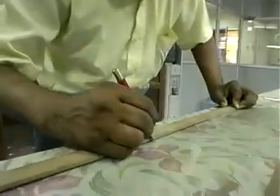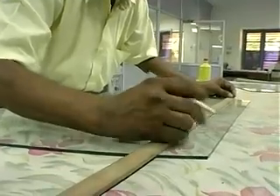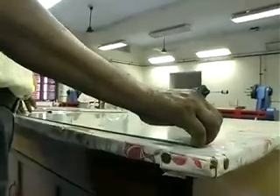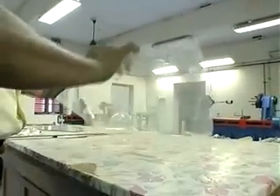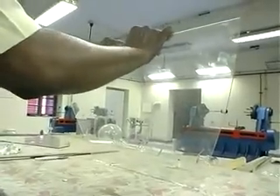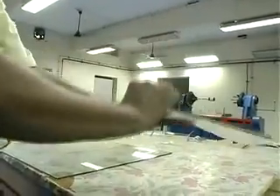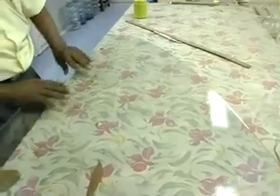It is extremely difficult to literally cut through the glass without causing the glass to split and break. People who work with glass score it, creating a line of weakness along the glass which can be exploited by gently bending the glass against the score, encouraging it to snap along the score line. When done properly, the glass will break freely along the score.